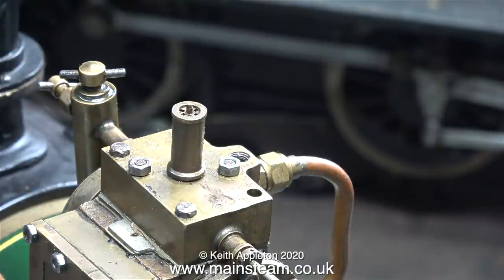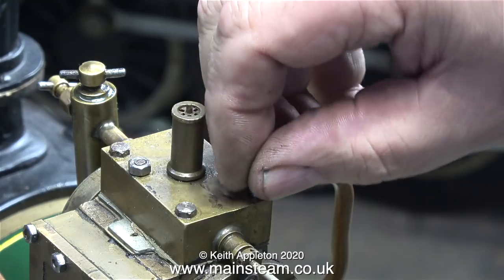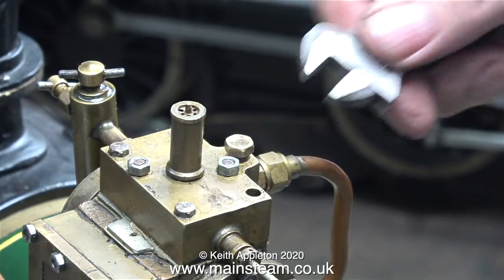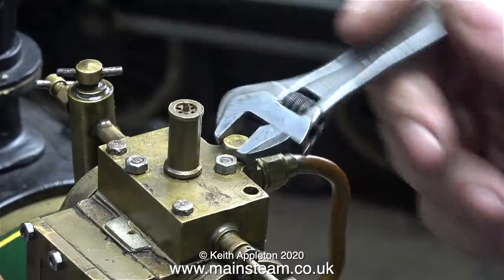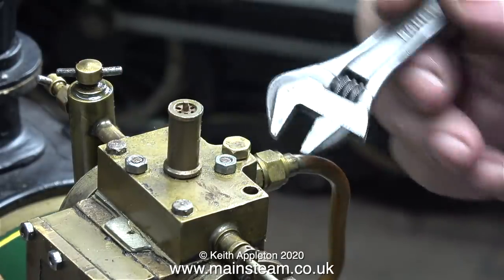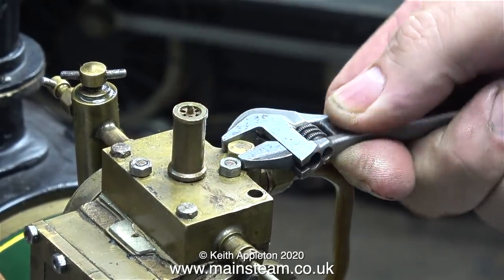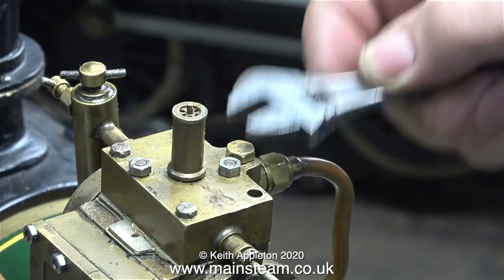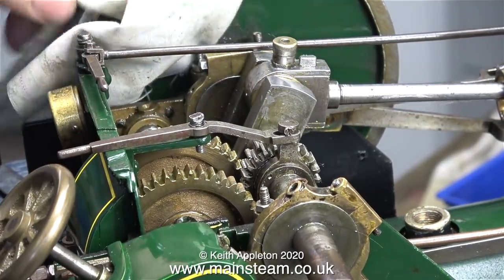I'm going to remove all of the M5 bodgers — in this video I'm only showing me removing one. When I try a 4BA bolt (BA stands for British Association) it's a rattle fit in the hole. Here I'm temporarily fitting a blanking plug into the hole where the whistle was, just to stop anything from falling in there. If you look at the steam chest cover on the extreme left hand side of the picture, you'll see that the fixing studs are nowhere near long enough — I'll put that right in the fullness of time. Any metric parts on this engine will be removed immediately. What I'll probably do is make special studs that are M5 at one end and 4BA at the other, just like I did on the old beam engine.